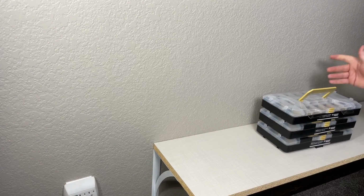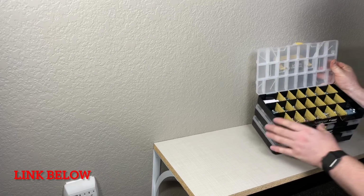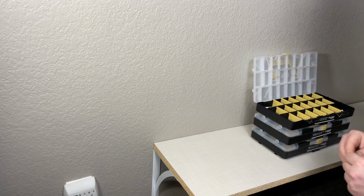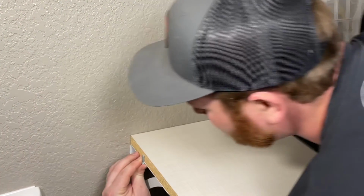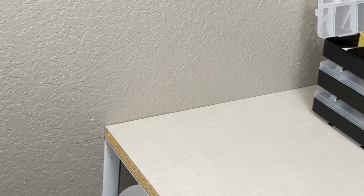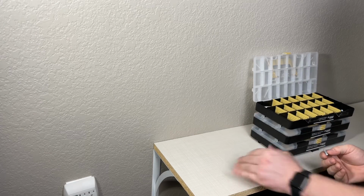And what I like using is I've got this handy kit from Jackson Palmer that's got every shape of screw and size, relatively. So you want a screw that's long enough so that when it stops at your bracket, it doesn't poke through here. And so this one looks pretty good. It's about 1/8 of an inch from the top, so it shouldn't poke through at all. You don't really need a ton of holding power, so I'd err on the side of being too short than too long.